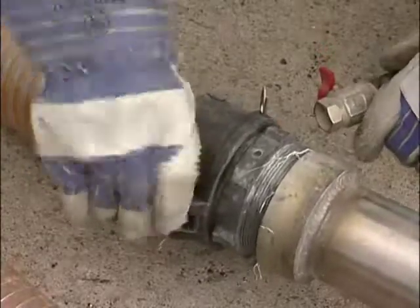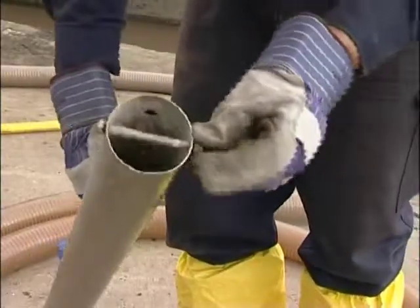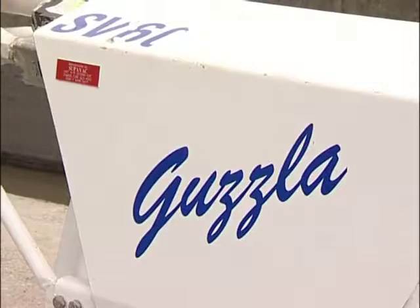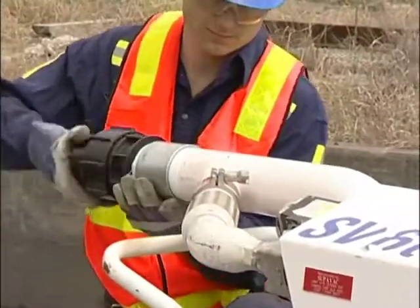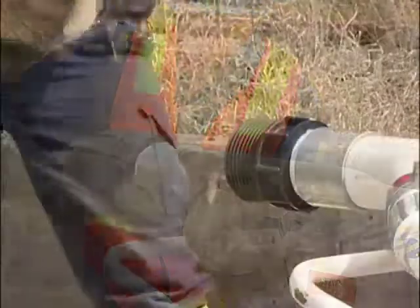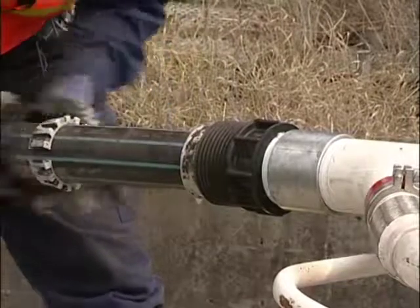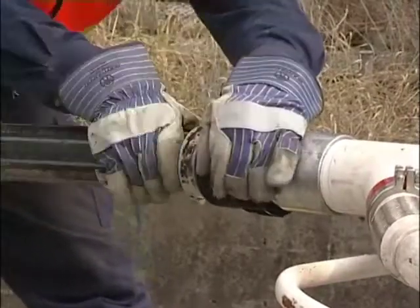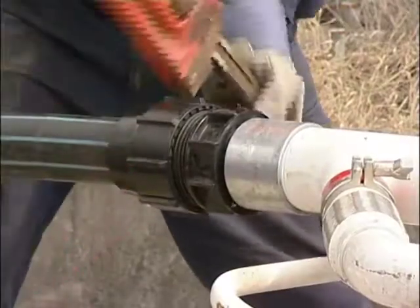A bolt can be installed across the nozzle to prevent oversized lumps entering the nozzle if necessary. You then need to connect the discharge line. The SV60 and SV60V can utilize a wide range of pump lines. These include poly pipe, rubber braid hose, and lightweight steel pipe. Ensure the correctly rated discharge line is used. Lay flat hose is not recommended.